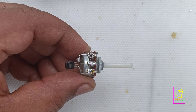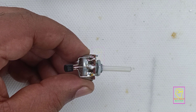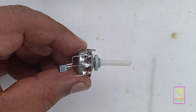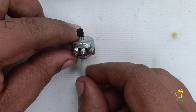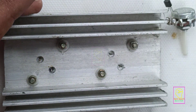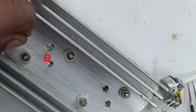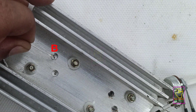We are going to use this property of the transistor in our circuit. When you look at a MOSFET, it is a voltage-controlled device — the gate voltage determines the drain-source current. In our circuit, BC547 is used as the driver to the power transistor 2N3055. We can even combine this circuit with a varying voltage power supply to build a varying voltage and varying current power supply. We can also increase the output current by connecting two power transistors in parallel.